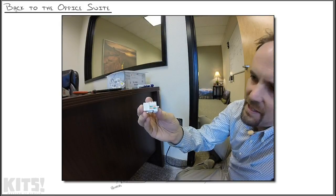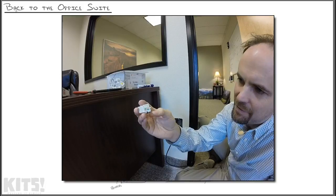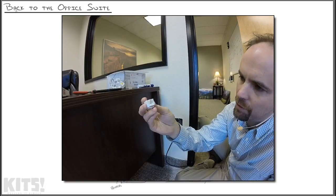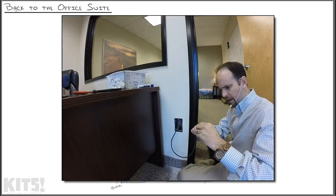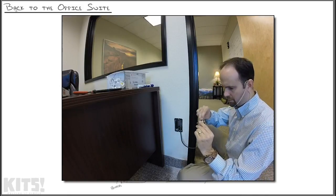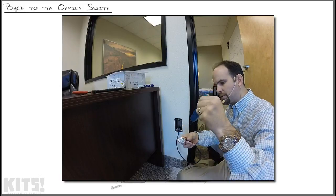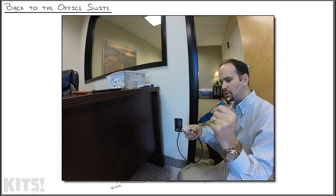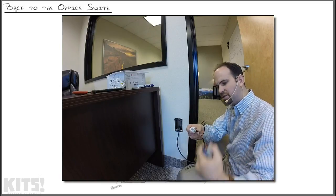Right on the side of the Keystone jack, they show you the 2 different standards, T568A and T568B. You want to use one or the other, and you can see on both sides showing you which colors go where. Now it's just a matter of lining up the wires to the colors. There we go. Punch down tool. Now I'm going to use this to take each one of those wires and punch it down deep in there to where it actually strips the shielding of that individual wire and touches it to the contact.